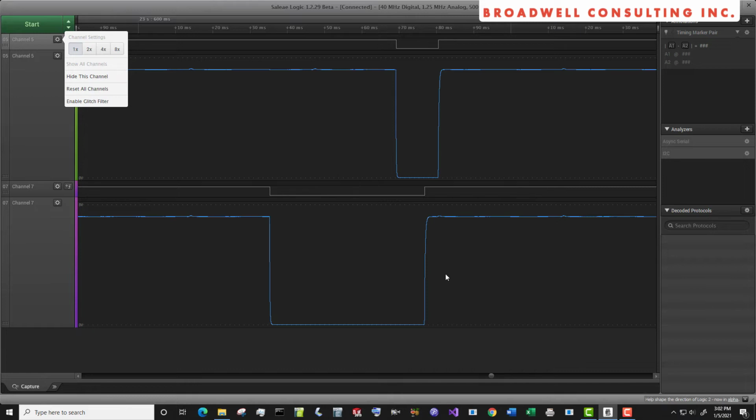If I was going to do some serious work that required me to absolutely be sure to catch every pulse, this is the rotary encoder I'd want to use. This would be pretty relevant if I was moving a motor back and forth and wanted to make sure I absolutely knew where the position of the motor was. Those RC caps, the RC filter is a good thing there.